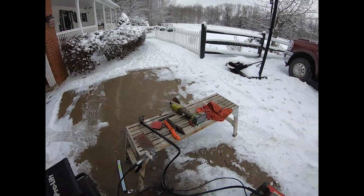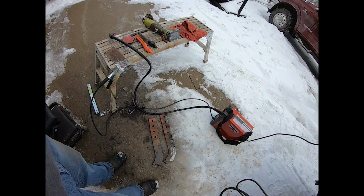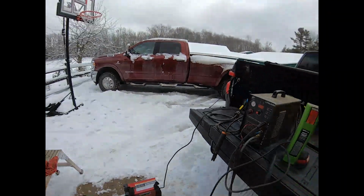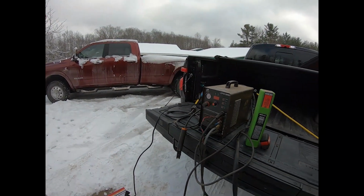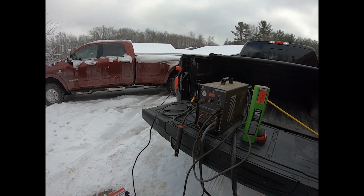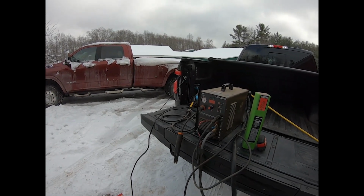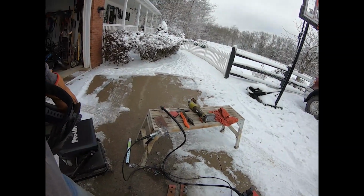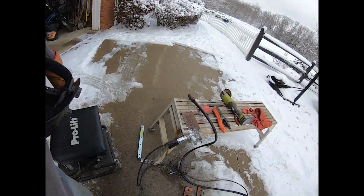I figured that would be the best welder for this thing, but overall, the Lotos LTP 2000 DC 200 worked pretty good. Stick welder worked good. It's going to work good on probably up to 1/4 inch steel. Hooked up to the Lightning, I think it does 3/8, you know, all the way up. I could only run it at about half power before blowing the breaker on the welder. And then the plasma cutter, it'll cut probably up to 1/4 inch as well. Took care of the 1/8 inch like nothing, cut through like butter, went through the unistrut pretty easily.